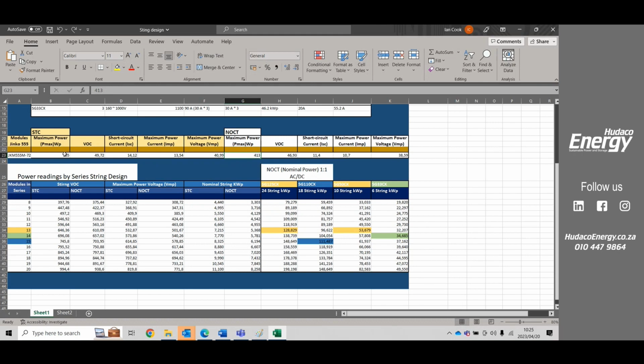Now there can be some instances where that module actually becomes minus 5 degrees, and that happens. If we have a look at maybe the Northern Cape, where it gets very, very cold, and at night your pipes can freeze up with all the water. Those modules could be at minus 6 degrees, and all of a sudden you get that intense sun, and it's going to be one of those hot days. Because the module itself has very low resistance, and the cables leading to the inverter are also very cold, that resistance is extremely low, and you can achieve an over voltage.